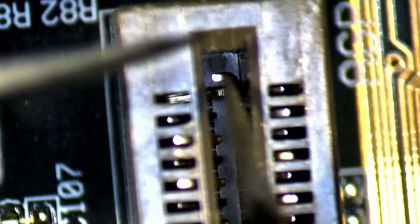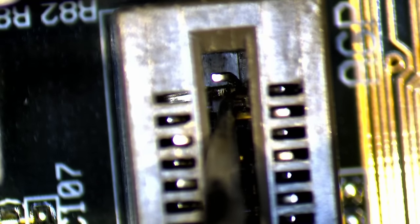First, the pin needs to go back into the plastic socket it snapped out from. And second, the metal proved to be far sturdier than I had presumed. Of course, those pins must withstand countless insertions of expansion cards. Therefore, it is reasonable that they are designed to resist deformation. Nevertheless, this one is mangled. Fortunately, the pin is situated at the end of the row, which somewhat simplifies the task.